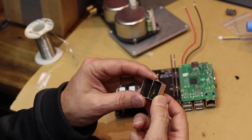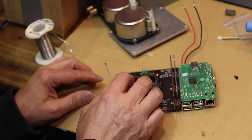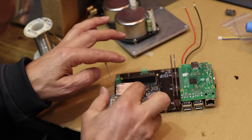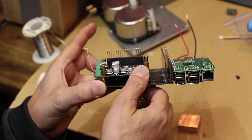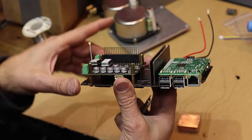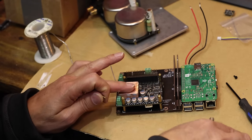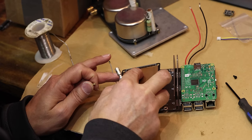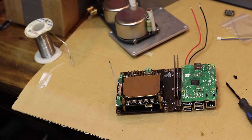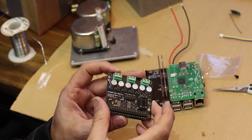I made this little cover for the clock. The copper shields are insulated on the inside with electrical tape so you don't get two types of metal touching each other and causing any galvanic problems. I put an extender on the GPIO — it's a little bit higher, and it also has a little sponge to hold things tight in place so they don't vibrate. You don't want those clocks moving when you crank the music up and the bass is rattling — you want to make sure everything is as solid as possible.